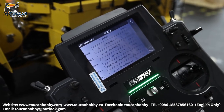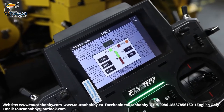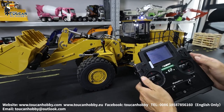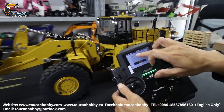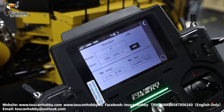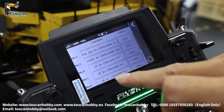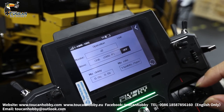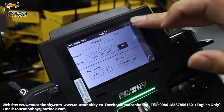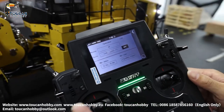You can start the pump. Mix number four — for switch it on, click these two points. So for our setting of the mix control to start the pump, we start from mix number four, five, six, seven. Mix number four: J1, the bucket, to start the pump — control curve. Mix number five: J2, that's the arm lifting up and down, slaves the hydraulic pump — same control curve. Another one: J4 steering, to start the pump — control curve, same.